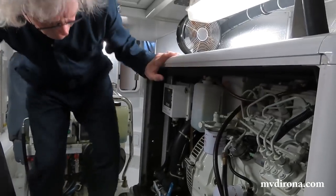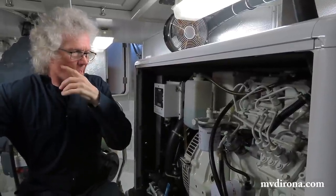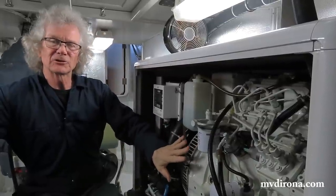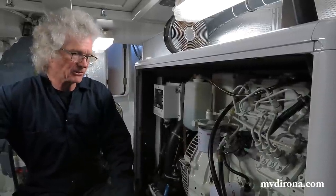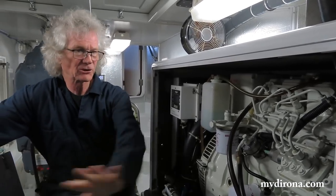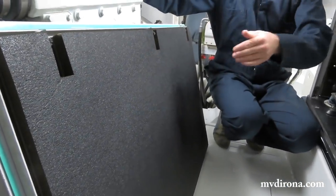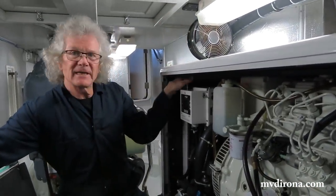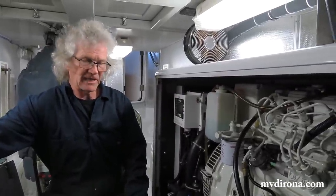And one more question. You mentioned heat. What do you consider high heat for this generator that would cause damage to the seals and things? Yes, it's a little bit debatable. Experts don't like the enclosure temperature over 130 Fahrenheit, so inside the enclosure, not over 130. I've never measured ours, so I don't know exactly what it is. The thing that you look for is to make sure that none of the sound dampening material is twisted away from the generator and is plugging up airflow, especially at the back or in here where the air flows in or the air flows out. Making sure all those passages are clear is absolutely vital.